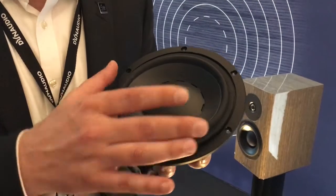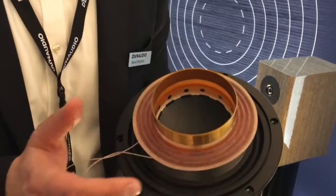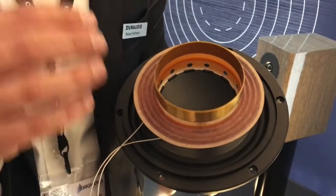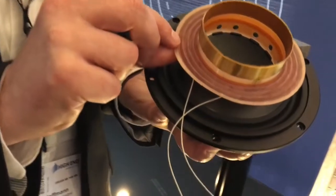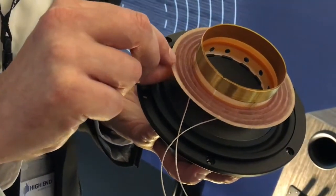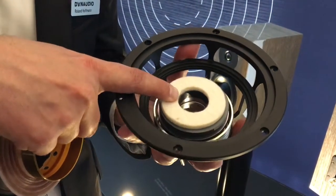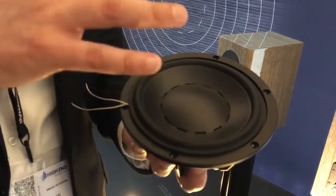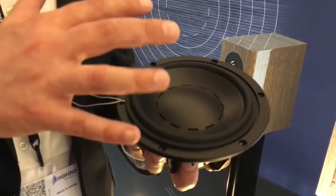The woofers are based on the best 17cm driver we've had so far, but our engineers couldn't rest, so they found some materials and ways to construct the woofers to make it even better. For example, this uses a glass fiber voice coil former and a new spider suspension material called Nomex. They combine a very light and rigid cone with a neodymium magnet — a very powerful magnet combined with a very light cone and voice coil. So the power handling is very, very good on this one. Even though it's a compact speaker, the power handling is excellent.